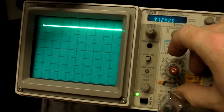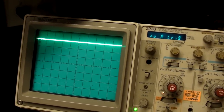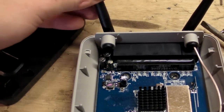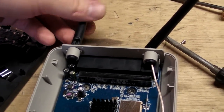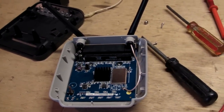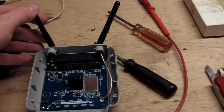Going back to DC, it's reading pretty much six volts, which matches what I was measuring before. So I'm going to crack open the router and see if there's anything wrong with that. Check this out — you'd think you get something for your money with two antennas on it, but one is a dummy. This one has a coax going up into it — that's the real antenna. The other one is just fake. I can't complain since I bought this thing at Best Buy many years ago; maybe next time I'll spend a little more money and get something better quality.